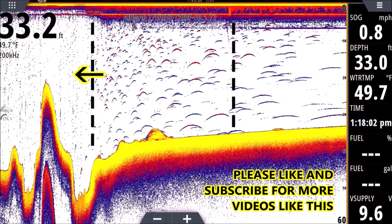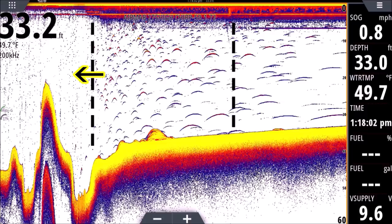The returns on the left here are little tiny dots. The reason they're tiny dots is we were running 40 miles an hour — on plane. Because we're going so fast, each little fish, each little shad, only had a chance to absorb maybe one ping. So we're cruising quick, one ping hits it, it shows up as one little dot. If you look towards the bottom-left, you'll see two little arches — those are probably catfish, four to five pound range — but even a bigger fish won't look like a proper arch at that speed. I call them light bulbs at that speed.